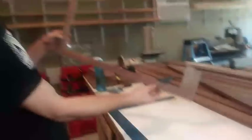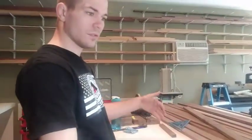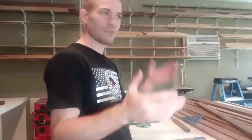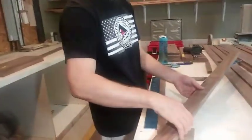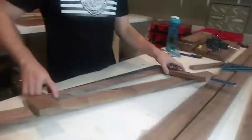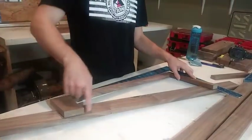Here's a face frame that I've assembled — this is the front of the cabinets in the back. You can see it's just attached with glue and pocket screws. We're going to get this last piece. On the program, because it's at an angle, it was something like 15/64ths or something like that, and I don't even want to mess with figuring out what that'll look like on my saw and then recreating it. So as long as your face frame is square — and it is — I can just take my 2¼-inch stock, simply lay it over the top like this, as long as it's even there and there, mark it, and that's my angle.